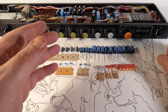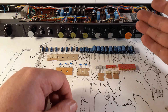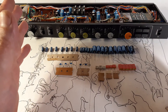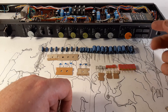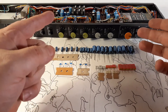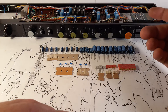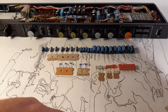I'm going to go through and recap this thing. The way it works is I use a desoldering gun and suck the solder off of the circuit board on the back, then I loosen the parts and pull them out like teeth. I'll do it in groups and I have one I've already built in front of me for reference. If I didn't have that, I'd refer to the pictures I include — electronic documentation with the kit in the form of written instructions, a map showing the layout of the board, where all the caps are and what they are, and a chart to reference the old parts to the new parts. For example, C37 is the main output cap — it's either a 33 or 47 microfarad stock, and I replace it with a 330 microfarad. So each number on the chart will correspond, and there's also a picture of the finished kit.